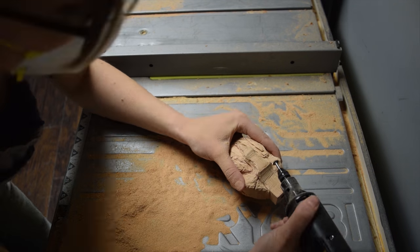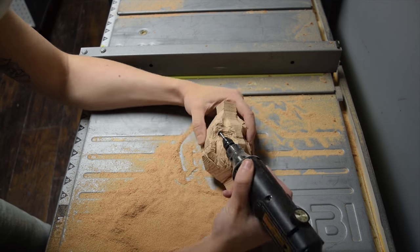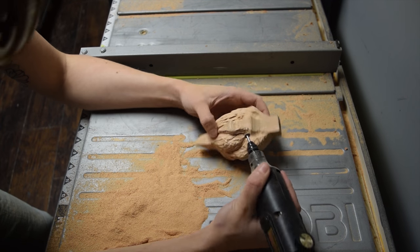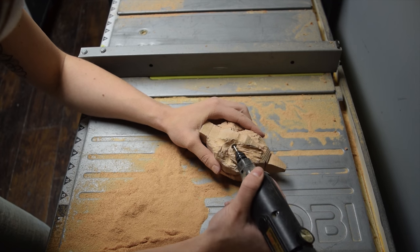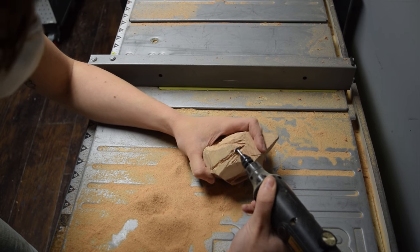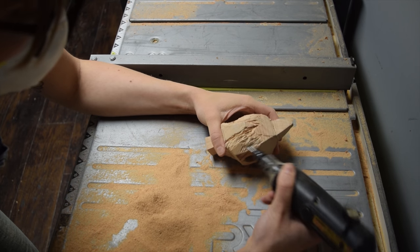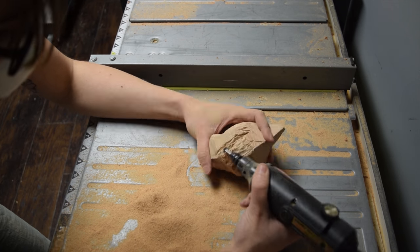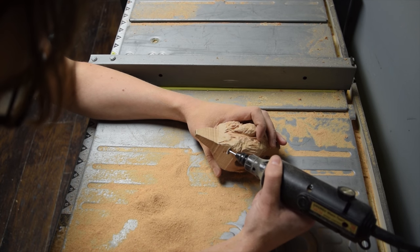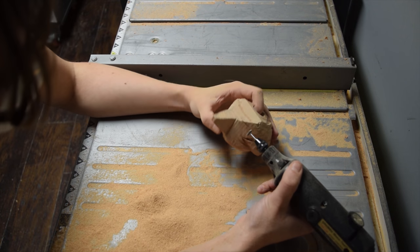However, for more rounded shapes, I used a more vertical push-pull up-down motion, giving us nicer curves around the knuckles and in and around the claw. To get the outline of the brow, I simply dragged the circular high-speed cutter across the face in the shape of the brow, avoiding any major gouges while still marking where I'd need to cut.